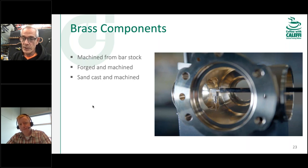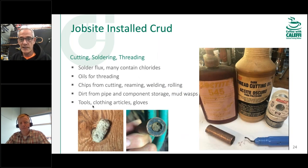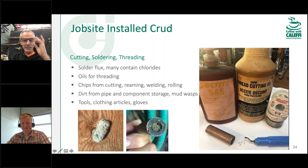The first thing you want to do is identify what's in your system. Is it just grease and oil from manufacturing and metal chips from cutting? That'll come out easily with a soap or detergent. But if it's hard scaling — like the white deposits shown in an earlier slide — you'd want an acid-based cleaner. What I found in pipes in Missouri: one pipe had a mud dauber nest inside — anything with a hole in my shop is going to have one. If you put that in the system without checking, you might not get water through it at all.